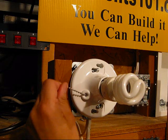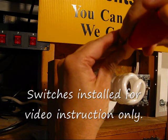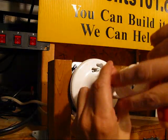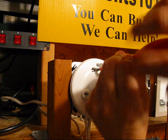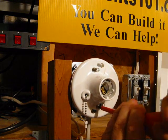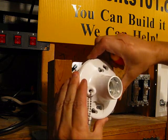We've got the power off now and the camera moved a little closer so we can see what we're doing. We're going to take the light fixture off. You're generally going to want to take the light bulb out first so you don't break it. I'm sure the power is shut off to this so I don't have to worry about getting shocked. I'm going to take the light fixture right off, and when we pull it off we're generally going to find two wires going to the fixture.